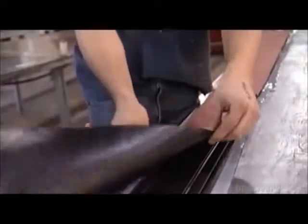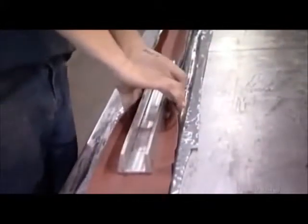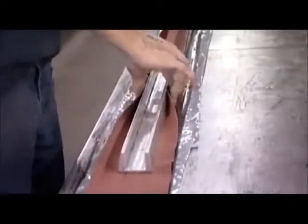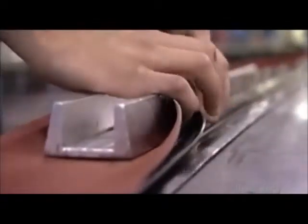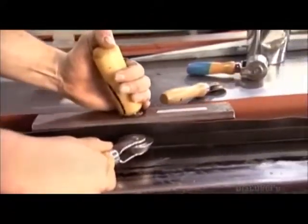Next, a worker places a piece of rubberized fabric and one of synthetic rubber on either side of the four-plied strip. He presses everything except the strip of rubber around a U-shaped aluminum former. With a piece of steel, he bears down on the shape so the layers stick together.